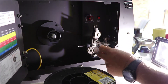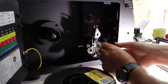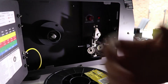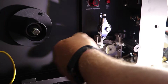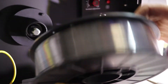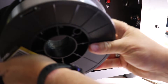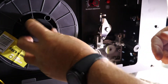It's designed for the gasless wire to get a grip on it as it goes through. So that's the 0.9 side — it'll go on that way so the 0.9 side lines up with the inside there, lines up with the wire feed. We'll feed it on. Make sure you get that little circle lined up with the little knob just there. Now tighten it up.